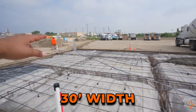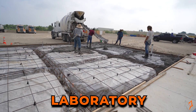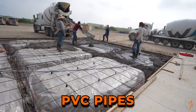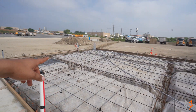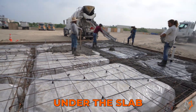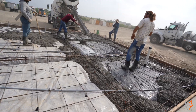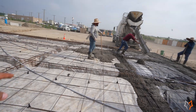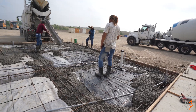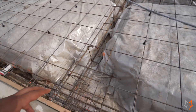This is a 30-wide, 50-foot-long metal building that is going to be used as a laboratory. The PVC pipes you see there are for electrical. Because there's not going to be a lot of walls, they're wanting to run all the electrical under the slab or through the slab. We had to coordinate with the electrical contractor — that took them about two days, and we had to kind of stop on the rebar for them to come in and do their pipes.